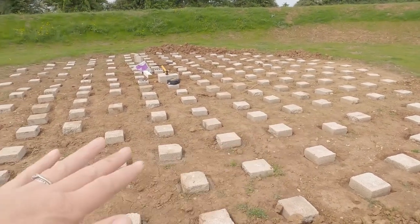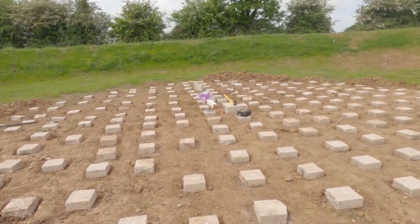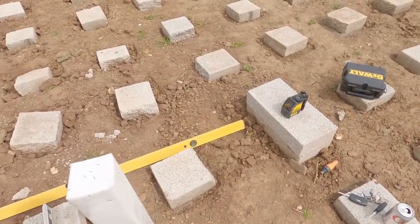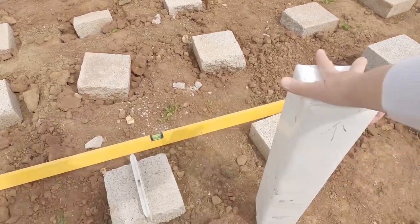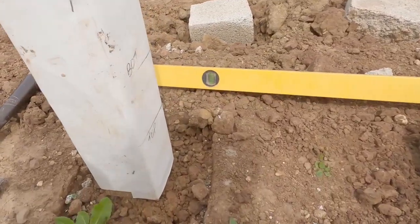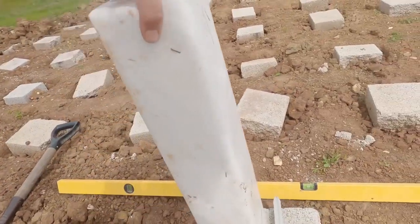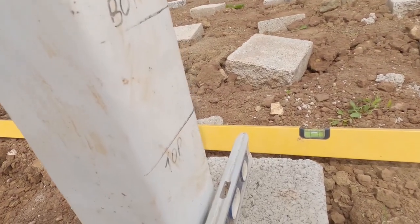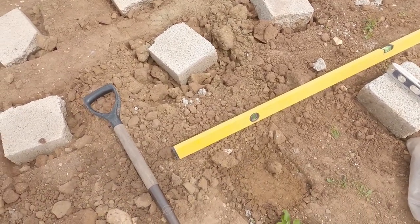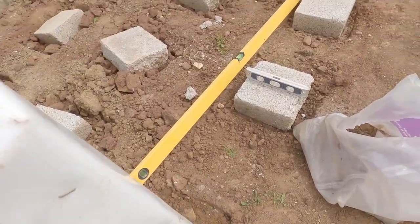We've managed to do this half and I'm now starting on this third quarter. So basically what we're doing — and it's so painstaking and boring — we've got this laser level, the most basic one, and we fashioned this little device so that when you put it in the bottom of the block without the block on it the laser should be in line with the bottom, and when the block is on it the laser should be on the black line that says 'top'. We're going around stamping this bit to compact it, then getting it level, putting the block on, and making sure it's level again.